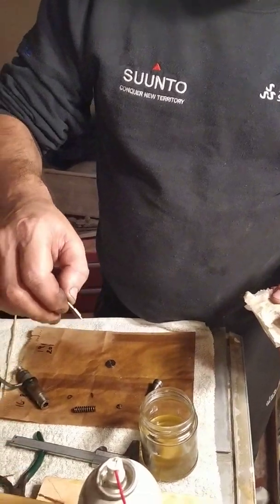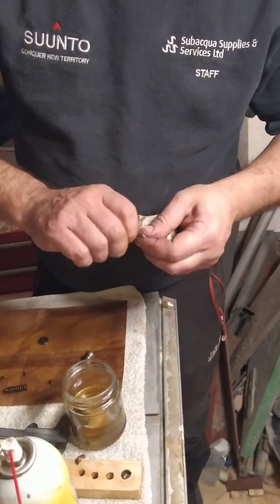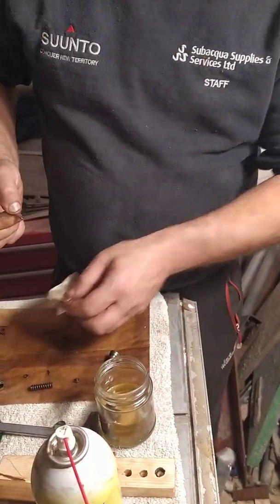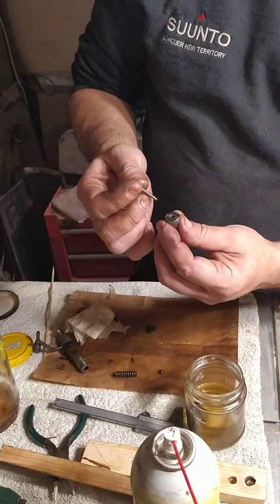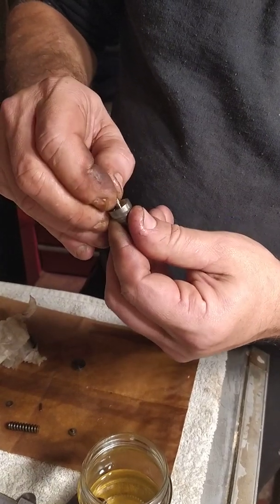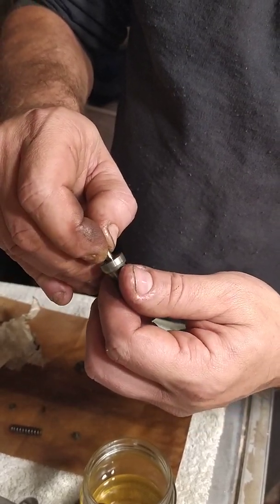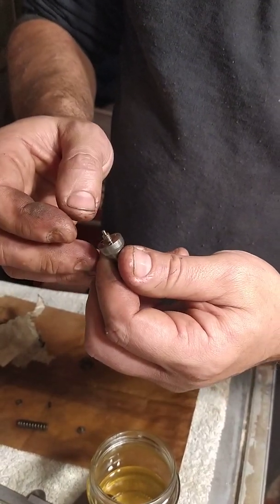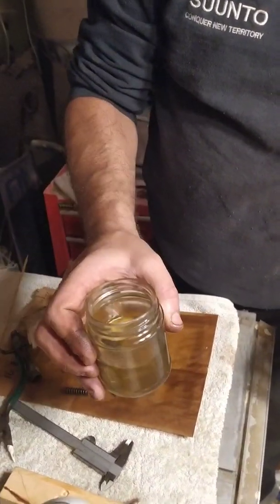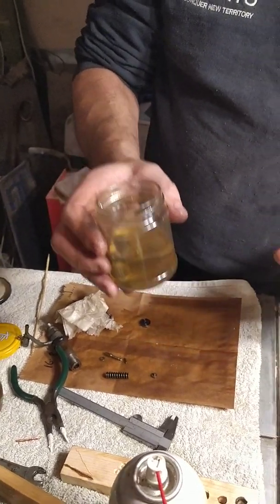You can clean the other side of the needle by dipping it in toluene, wrapping it around clean paper, then checking for smooth contact with the nozzle. If it grabs, you need to clean it more, or else you need to change the whole needle-nozzle assembly. I prefer to clean the parts with toluene, as it was suggested online.